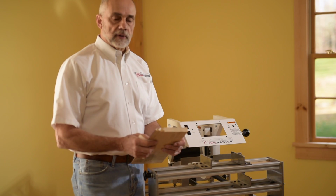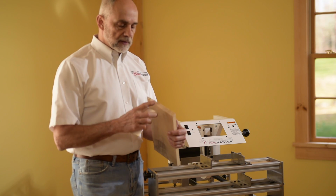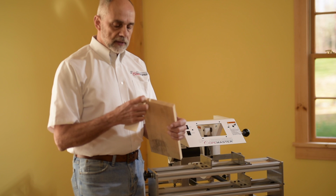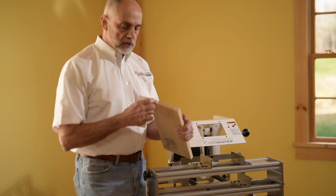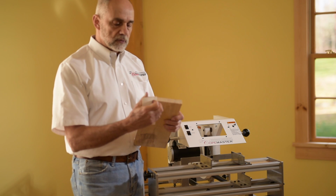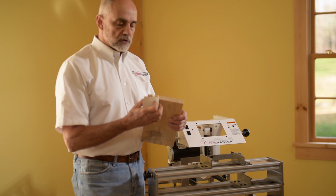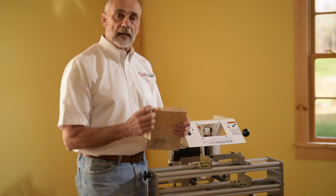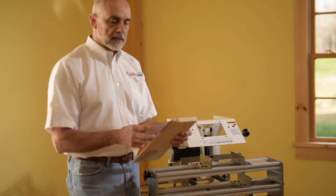So now that we've finished the template cut, we can take some 100 or 120 grit paper and we can sand the sections that might have some bumps in them. The straight section should be perfectly smooth and no problem. In here in the curved, detailed sections, you can just put the paper in there and sand a little bit, get it as smooth as you can. You want to remember that this has the curvature of the saw blade in it, and you want to sand with the curvature. You don't want to disturb that, because the stylus has the same curvature, so it's going to make full contact with your template. So again, 80, 100, 120 grit, do a little sanding, make it smooth. If you want, you can put butcher's wax on it. If you're doing a lot of copes, butcher's wax just makes the stylus slide a little bit easier. And now your template is done.